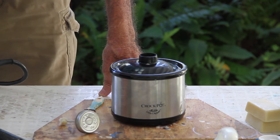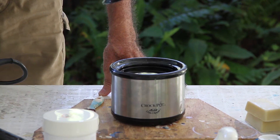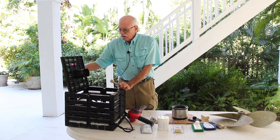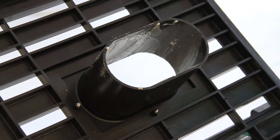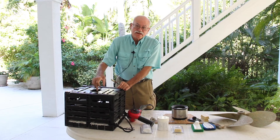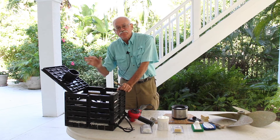We put our Barnacle Stop — we took it out of the 350 gram tub and put it in as a solid. It takes about 45 minutes to get the Barnacle Stop warm. The only part of a crab trap that gets Barnacle Stop is the funnel. The reason for doing this: if you don't apply Barnacle Stop, the entrance to the crab trap can get blocked so crabs can't get in. The other reason is that once crabs are in there, if there are any barnacles, it gives them a handhold so they can get back out.